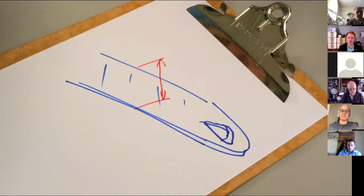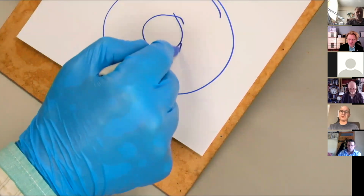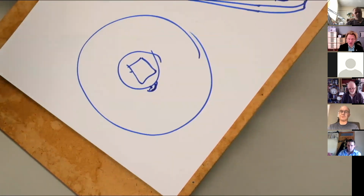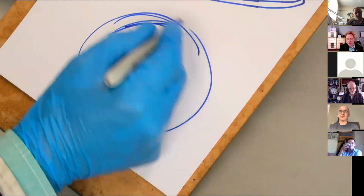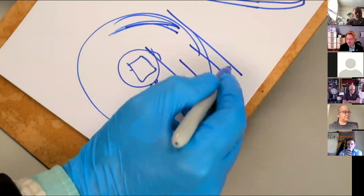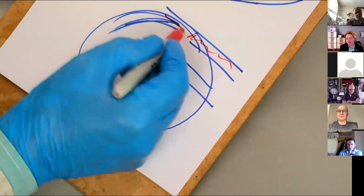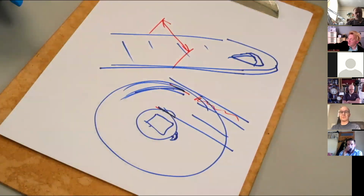We know as a rule of thumb, and I would always say don't build your practice on rules of thumb, but let's just do a little drawing here. We're looking in plan at the barrel. Here's the barrel arbor. Here's the fusee setup square. Typically, when the spring unrounds, as a rule of thumb, the spring wants to occupy about 1/3 of the value between the barrel arbor and the inside barrel wall in terms of length. That's only a rule of thumb. That really doesn't matter. Just buy a long spring and cut the end off it until you're happy with its length is a simple way to approach that.